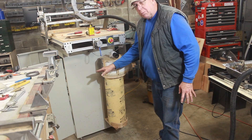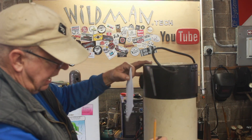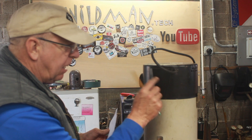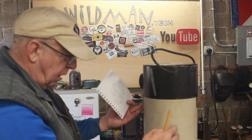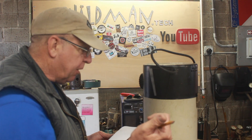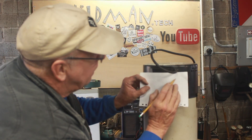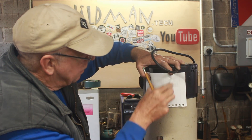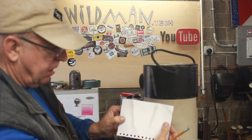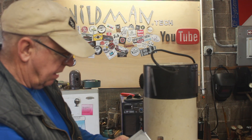All I need to do now is hang the new vacuum cleaner and wire it. This here is the bracket it hangs from. The canister was equipped for an additional bracket, but I think I'm just going to hang it off the motor. When I want to remove the canister — which is going to be pretty rare because the Thein baffle catches everything anyway — I'll just let it hang. I need to take a tracing off this; just folding the paper will give me the pattern. Now I need to make a receptacle that will slide into that, and that should not be much trouble.